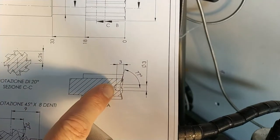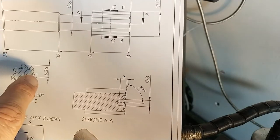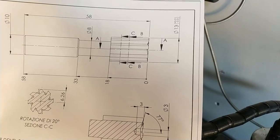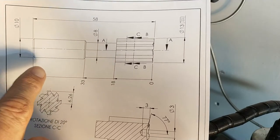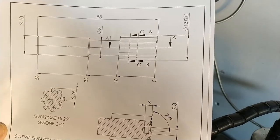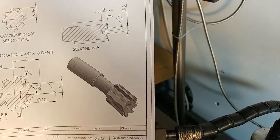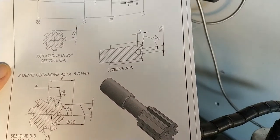We will make also a drill hole that will be a support in the future to cut with the divisor, so with the milling machine. And okay, so we'll start from a steel that can be hard. It has 0.4% of carbon, so it will be hardened with flame, with my flame, and the final result has to be this. So okay, we start from the round bar and we see how it will be.